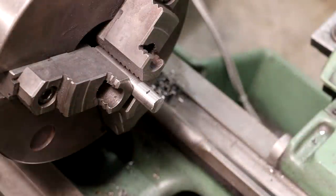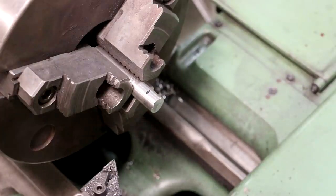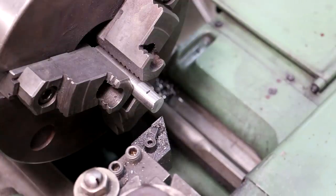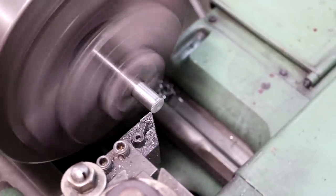We'll start out by making that little piece with the center on the end. This is a piece of five-eighths inch stock and all I want to do is turn a half-inch 13 stud on the end of it. We'll do this over on the metal lathe — let's get it fired up. We'll start by facing that.